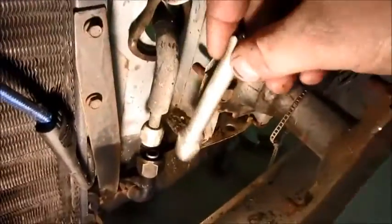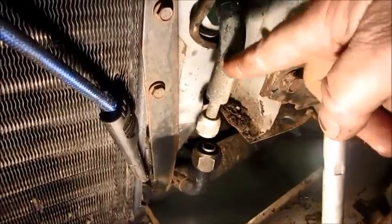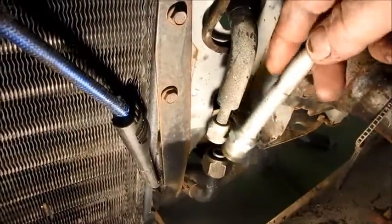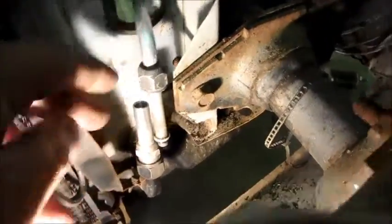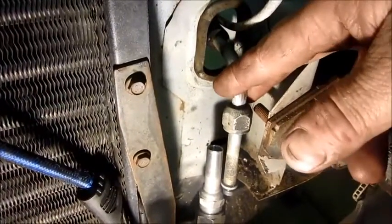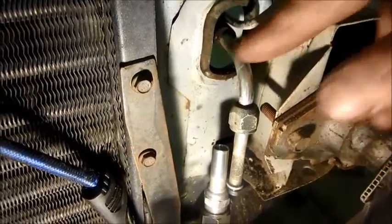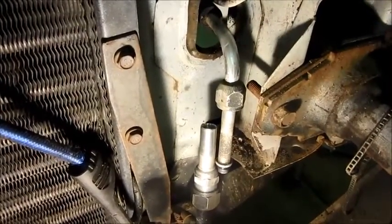I've got this piece. I'm going to put this in here, mark it, then take this line out, cut it off, and use this end instead. I cut off the insulation so I could slide it out of the way. I'm going to cut that bead off, slip the two together, and mark it where this is in the middle of the slot here. When I put it back together, it's not going to push on the body. So slide it in there, mark it, and then I can braze it.